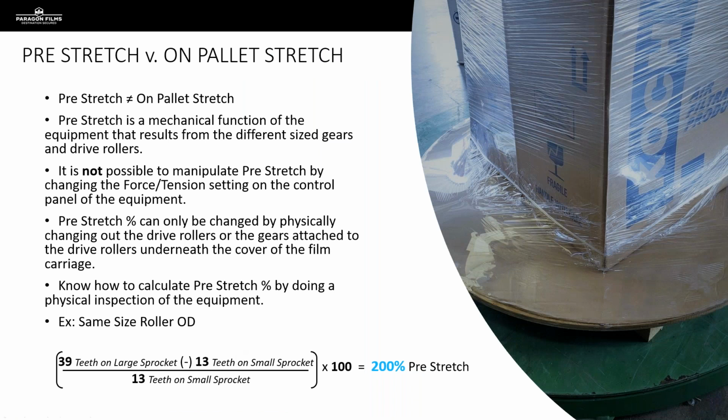So now we're going to get into pre-stretch and on-pallet stretch. And pre-stretch versus on-pallet stretch, it's important to know, like we've already talked about, pre-stretch is not on-pallet stretch. So we talked about pre-stretch is what's going on with those gears and those rollers inside the carriage. On-pallet stretch is what we're actually achieving on the load.